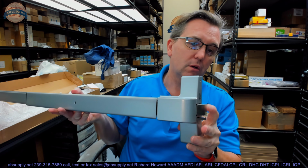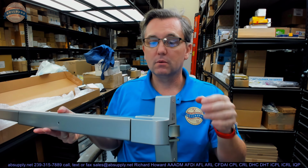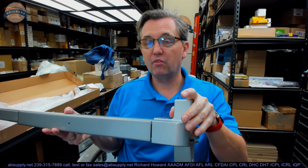Well, that gets to, don't quote me, but 1,800 degrees within 3 minutes and parks there for the next 2 hours and 57 minutes. Because let's say that the door is metal or wood, doesn't really matter. That material will shrink or expand. The frame will move or bow or twist or warp. And if the latch bolt becomes disengaged from the strike plate because it's not held in, the door may swing open. And the door assembly will fail the test.